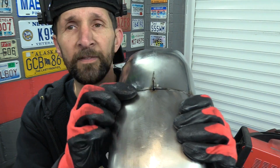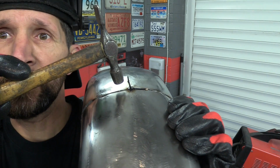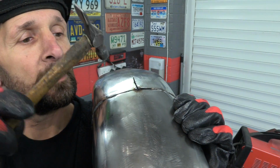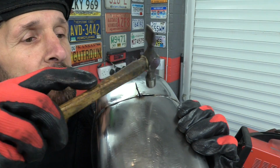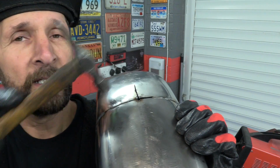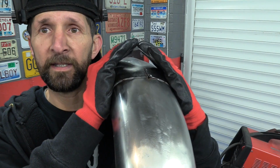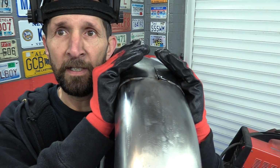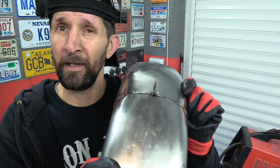So all I do, I've done that side, as you can see. Take your little toffee hammer, and you just tap that side down into that, then meets it. And this one, as you can see, then you just tap that down in. So as this one at the back was more like this, that's exaggerating it. All I've done is cut a slit there, and then when you hammer them down, the slit comes together and you just weld it up. So it's just making it up as you go along.